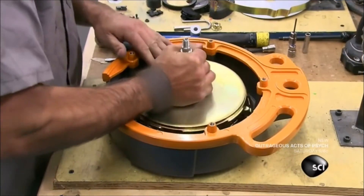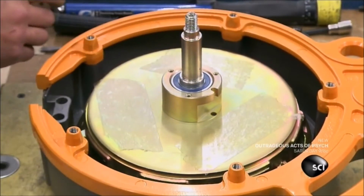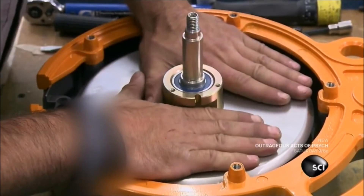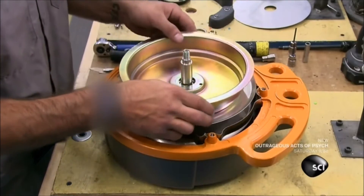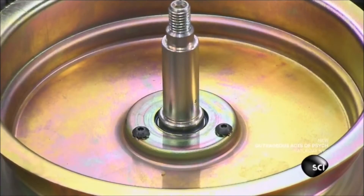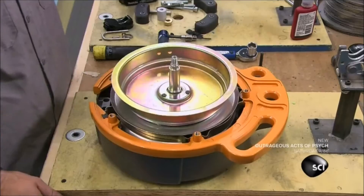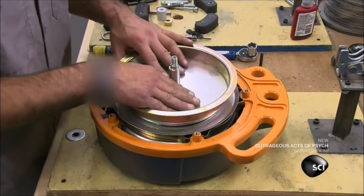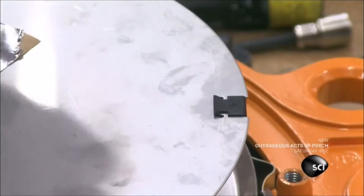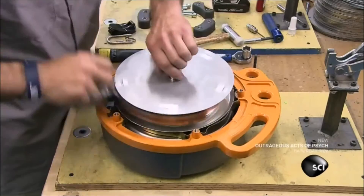After protecting the brake core with a metal plate, a worker puts the unit in a plastic case. He installs the plate on the shaft for the webbing to sit on, then loops the webbing around it. He also places a drum on top for the retraction spring, applies silicone adhesive around the drum to secure the aluminum base plate, and then inserts the retraction spring, capping it with a metal plate and reinforcing the clips with metallic tape.